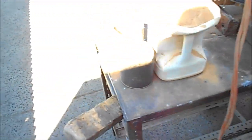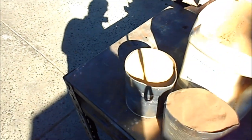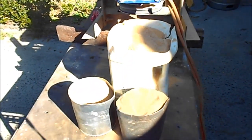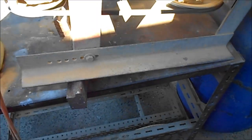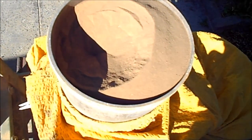The other material I use is this — used sand. It's been again dried and passed through a finer sieve, about a half mil opening, and I do that to get rid of small pieces of metal because they're very destructive on the grinding disc. I simply add the two of them one at a time to the hopper at the top, alternating, and as you can see it goes down, but ever so slowly.